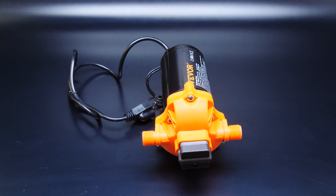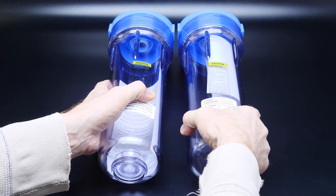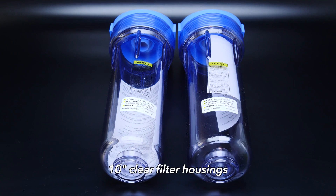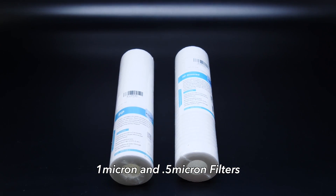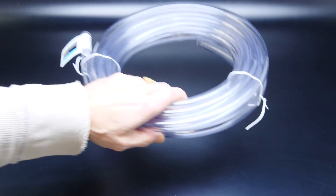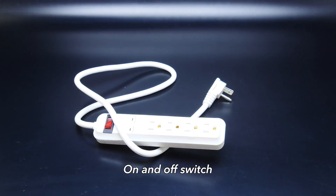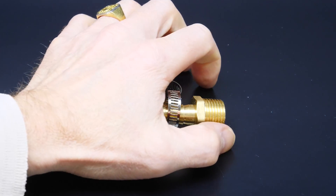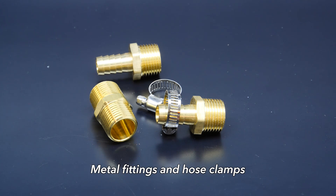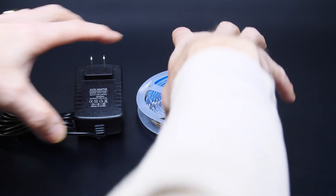To build one of these IPA filtration systems, you'll need a chemical-resistant diaphragm pump, a couple of filter housings — these are 10-inch ones. Readily available filters, like these, are cheap and easily accessible. I'm using a 1-micron and a 0.5-micron filter, some clear vinyl tubing because it's cheap, a power strip so I can turn the whole system on and off, some miscellaneous metal fittings, hose clamps to put it all together, and maybe some UV lights so we can harden up the resin in the IPA. There's a link to all the materials in the description below.